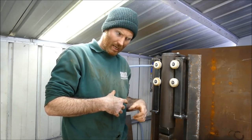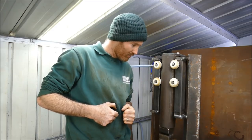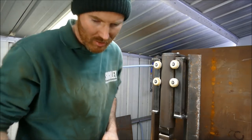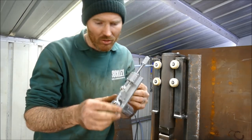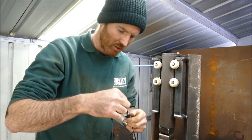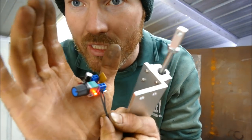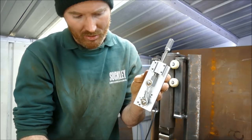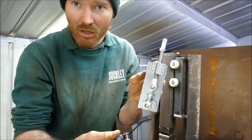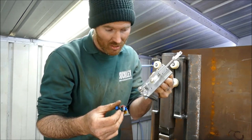upgrades for the power hammer and my tendencies to fluctuate between engineering and traditional blacksmithing, I've got another upgrade that you might be interested in. So right here is an off-the-shelf, believe it or not, linear motion reciprocating motor. Again, in the description, I can show you where I got it. Essentially, all I've done is I've stuck a 12-volt potentiometer onto it, this being a 12-volt system. It's a 200 RPM geared motor, and if I just twiddle the knob here, isn't that cute?